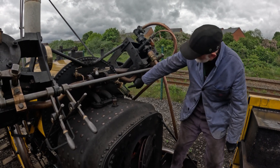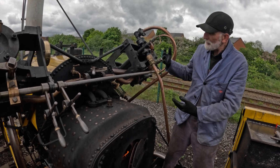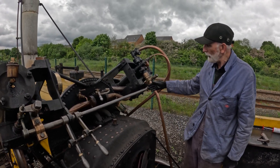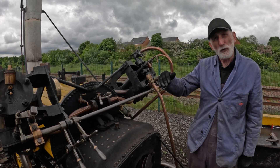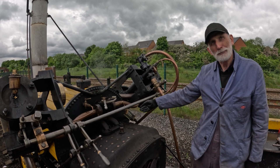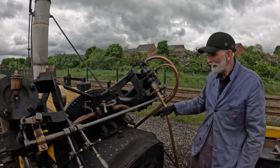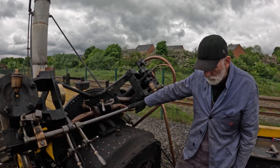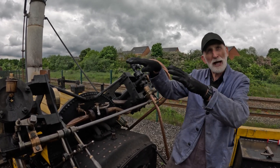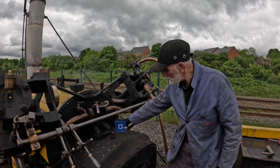There's a black and white frame behind the glass and the water contrast shows the level. It's important to monitor water level as you travel along, as it bounces up and down. If you're going uphill, it will appear full; if going downhill, water flows to the front. That's why more modern engines have a tapered boiler — to stop the water washing around so the level reading doesn't disappear.